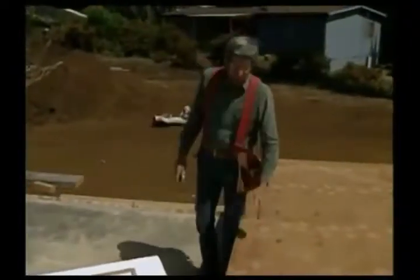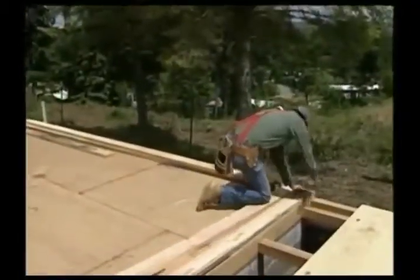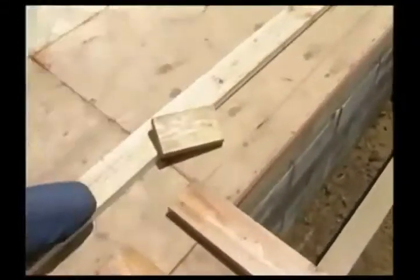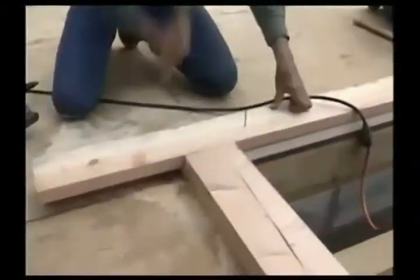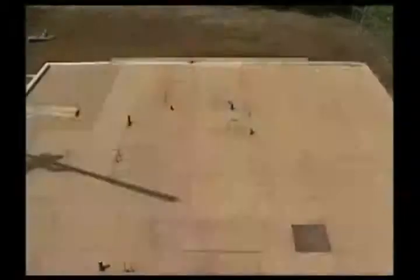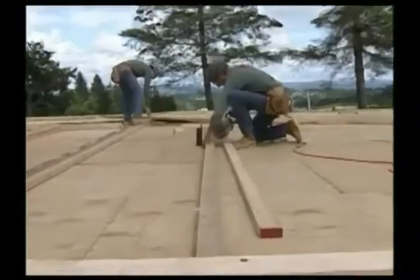Next step is the plating, the process to cut plates to fit and arrange them on the subfloor. The bottom plates are temporarily tacked on the lines previously marked. The top plates are tacked on top of the bottom plates. If there are pipes on the way, the top plate is tacked on the side or set on the edge. Next step is the interior wall plating.